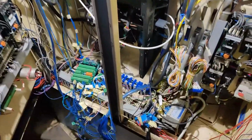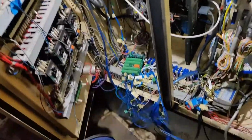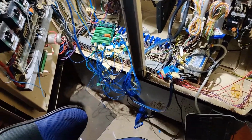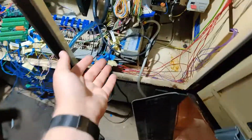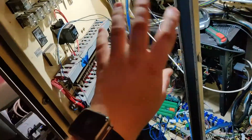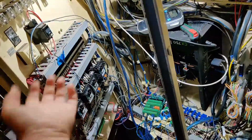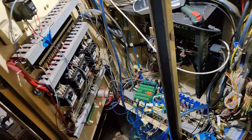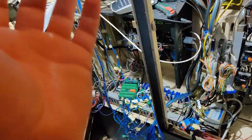I've also begun working on the CNC lathe, the small Mazak lathe. Bought myself a new 7i76 and have begun wiring up all the connections. Instead of just wiring up the connections I had before, I really wanted to get more of the features of the machine running, like the spindle orient, the live motor option, coolant, tool setter, parts catcher. Basically get as many toys working as possible,